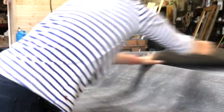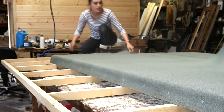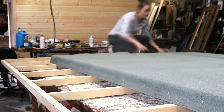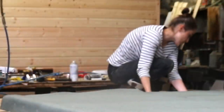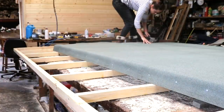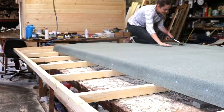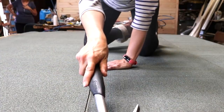Because it's pulled back, I could then place my middle section there, overlap the upper piece again and work out an even distance for the bottom two pieces. Again, also making sure all overhangs have excess to trim down later. Then keep that still so I can mark where the overlap falls on the bottom section of felt and then repeat marking where the top piece falls on the middle.